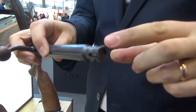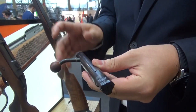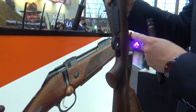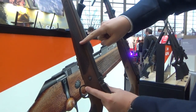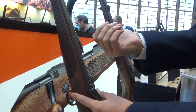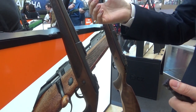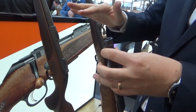We have six locking lugs in the medium and long size receiver, and three locking lugs for the mini size receiver. To change the caliber, you would normally disassemble the stock via two screws, remove the action, and then you would see three screws clamping the barrel into the receiver. Loosen those screws and you can simply slide off the barrel and put another one on — a different barrel profile or a different caliber. If switching to a caliber with the same cartridge head diameter, you don't need to change anything else.